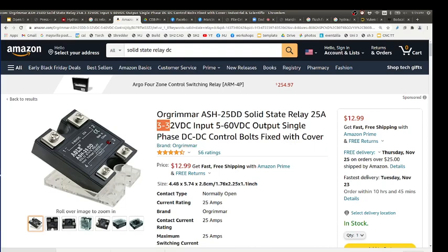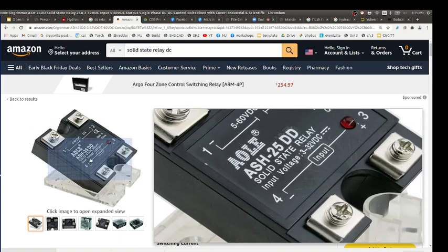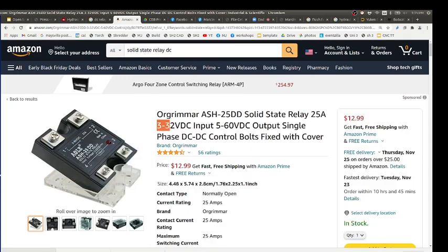If you've got multiple solenoids at the same time, let's say 3 times 2 of them, that's 6 amps at least. That's accessible enough. So from your Arduino, you can take any pin, literally any pin. It's got a bunch of pins. You need one signal pin and one ground pin, and you connect them to the signal part here, the input.